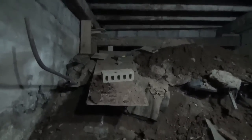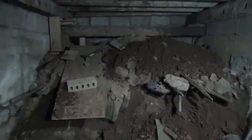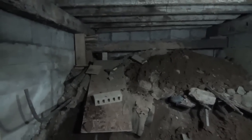But instead of taking that out, because I do need an even level surface for which to support the roof, I decided I'm going to put a footer right here, put a CMU wall about 3 or 4 courses high, level that dirt out, let it settle, compact it as best I can, and then run some footers lengthwise and support off of that.